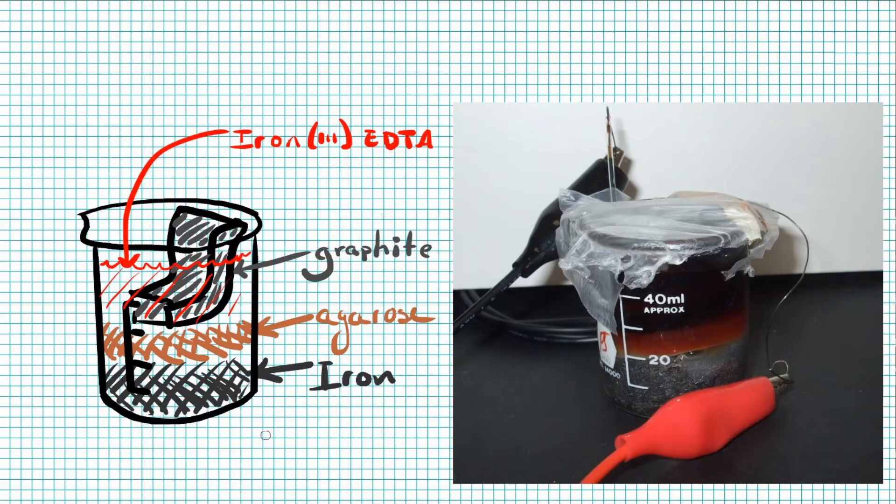I would like to report a little more about the iron battery. I've got some results for the charge-discharge of the second cell with the carbon cathode. In that case I'm using a carbon felt instead of a copper current collector. The voltages are very similar, which suggests that the copper wasn't participating a lot in the reaction. That's good.